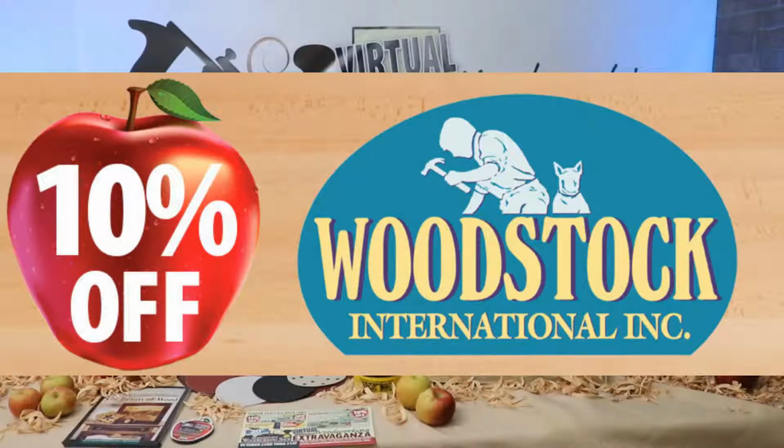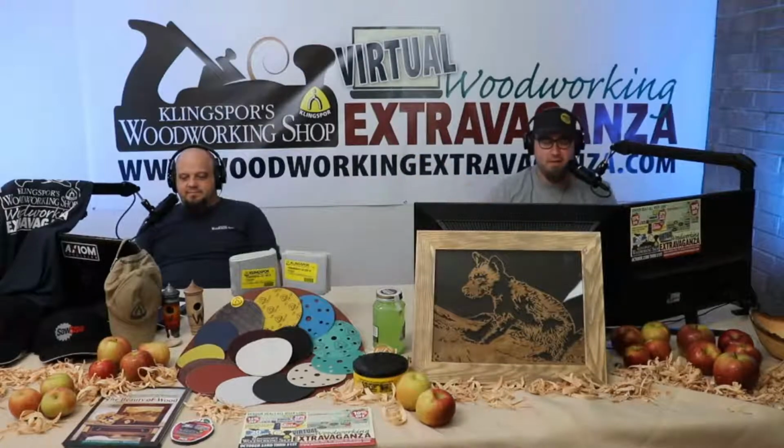One of the things that we have for you today is Scott Caskey, who's going to be joining us. He's also the gentleman who gave us lots of ash shavings on our table, as you can tell here. Scott is going to show you how you can take your bowl gouge, if you have a standard bowl gouge, and turn it into the Ellsworth Grind using a basic grinder. So let's check that out now.